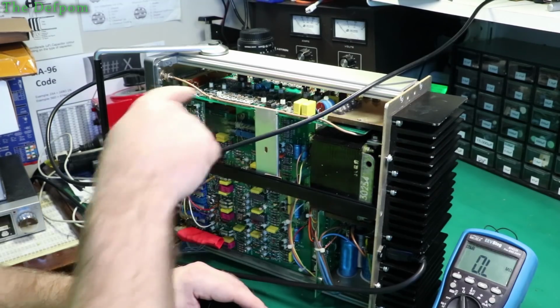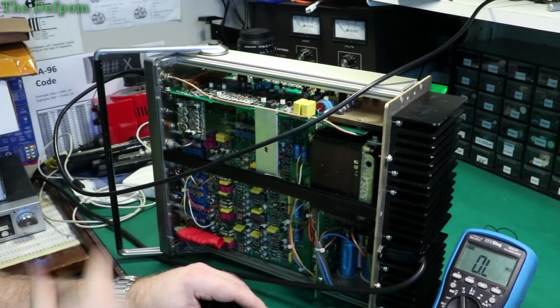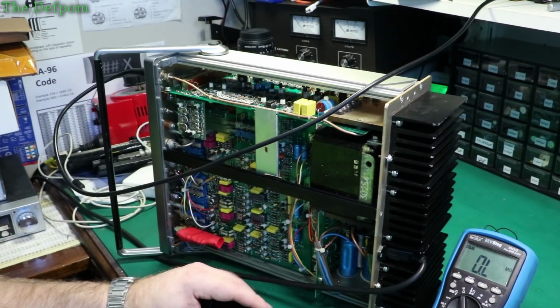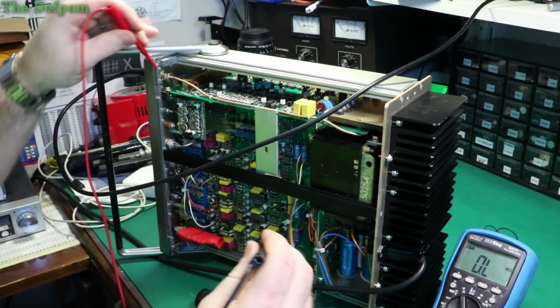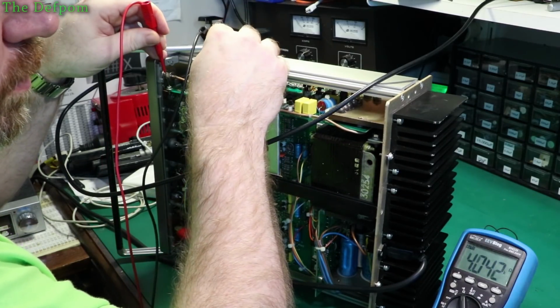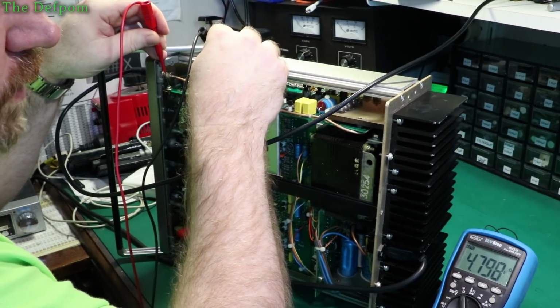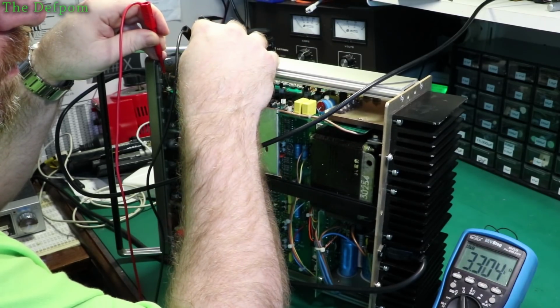So I just checked the resistance on the output, pin 6, to ground, well, the VSS reference on that op amp, and it seemed fine. I should do one to ground, actually. I'm assuming chassis is ground. It probably is. At the front, but yeah, that's all right.